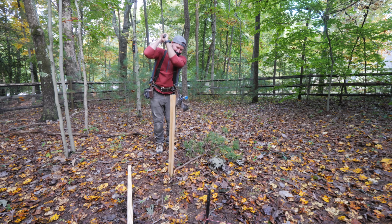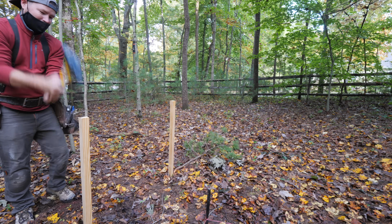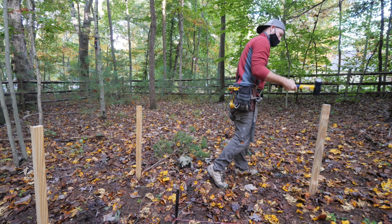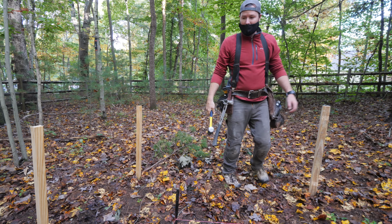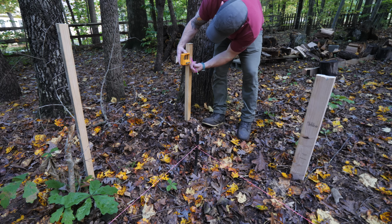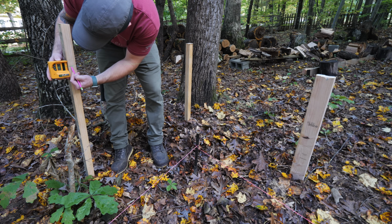We ended up setting the stakes off of our string line by about 3 feet, again to get them out of the way of the excavator. Oh! And we also made sure our stakes were long enough at the tall end of the building so that our string line would be able to be set to grade. Once all of our stakes were set, we could mark our actual grade on each of the stakes, which was 12 inches below our laser line.